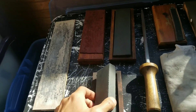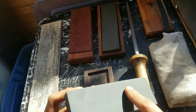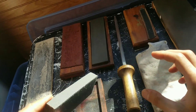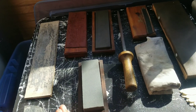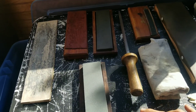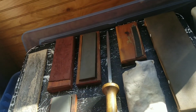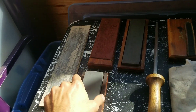The first thing is this dual-grit stone — it's basically 200 grit on one side and 600 grit on the other. If a knife were completely dull like a butter knife, you'd use the 200 grit first, then switch to the 600 grit. That's basically all sharpening is: going from very low grit like 200 to 600 to 1000 to 2000 to 10,000, as high as you want to go, to get the edge atomically sharp — that's kind of what you should aspire to, even though you might never get there.